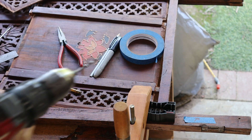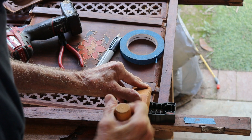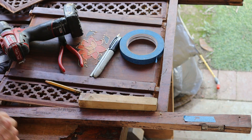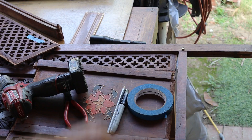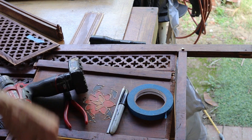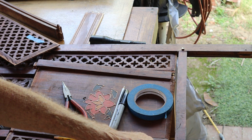Let's see if we can go right down the center. It would be nice if I saw some metal chips, but it's a pretty small nail. We'll see if I actually got it out of the way — I'll just take a little block and tap this. I think I was successful. I've got my magnet over here. I'm going to double-check my witness marks and do the same thing as I did on the first one. When we get back, hopefully we can just slide all this out, glue up our problem, put it back together, and then we'll use eighth-inch dowels, color the ends, to finish the job.